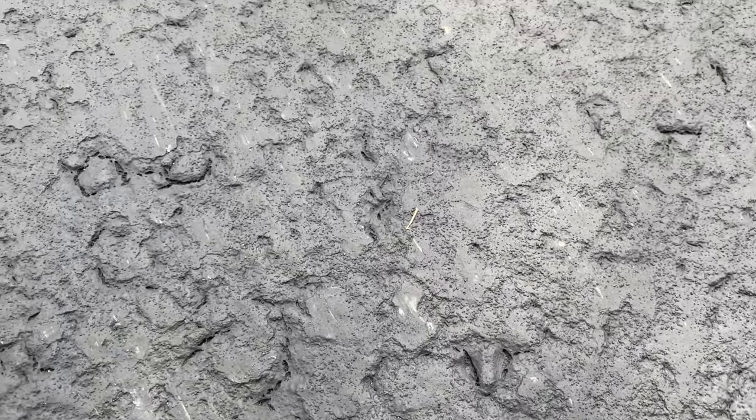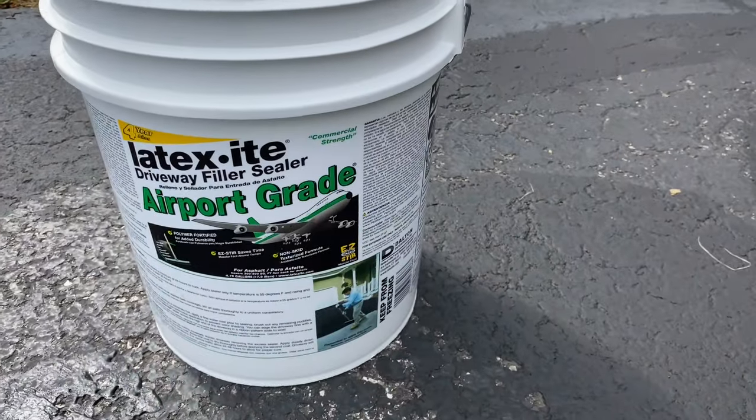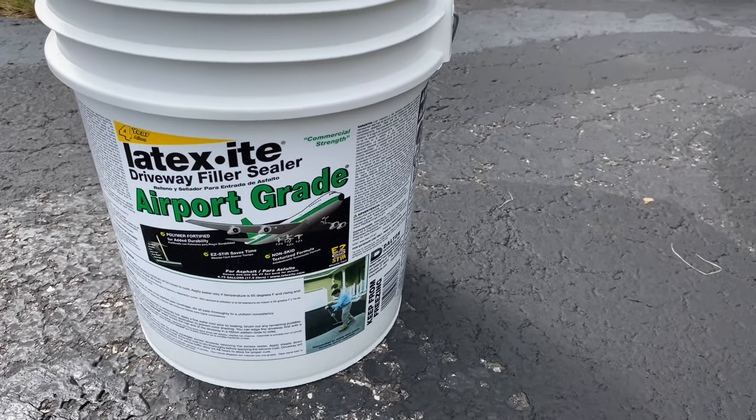Here's the before and after — once it dries it turns a pretty nice dark black and you can see it's filled in a lot of those cracks. For areas with really deep cracks or alligator skin you might need to do another pass to fill them in one more time. What I really like is it has a matte, almost sandpaper-like texture that's going to hold the seal coat in really well and give it a nice stable structure to adhere to. I really love this Latexite — it's the only product most of us need and it's actually pretty inexpensive. A 4.75 gallon bucket is only 20 or 30 bucks. I'd highly recommend picking this up if you're doing repair on your asphalt driveway. I'll put a link in the description below. Peter von Panda out.